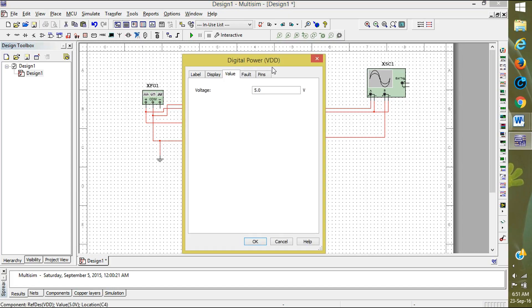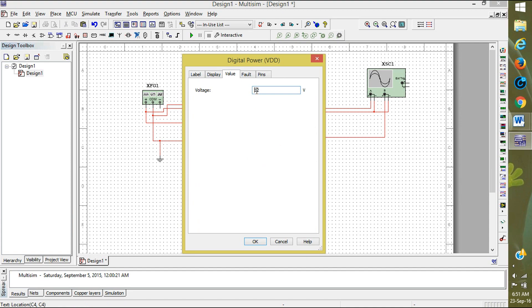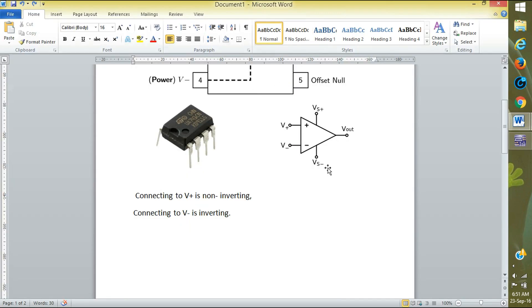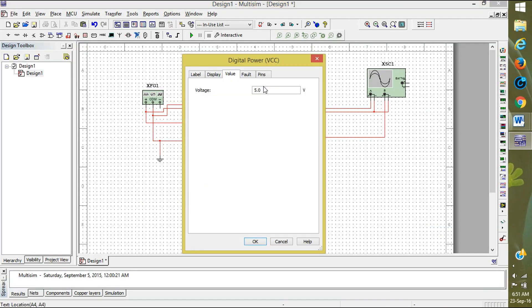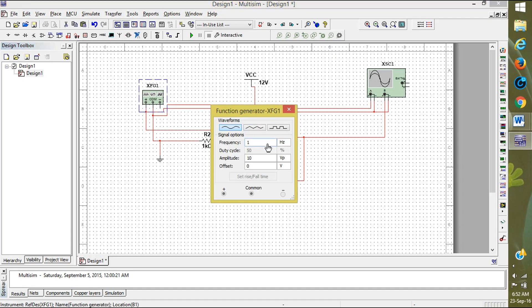Set the voltage value. Click on the number and you will get the value. I am changing it to 12 and pressing Enter — sorry, minus 12. For VDD we have to give minus voltage, since we need minus VS. And here set plus 12. So we have plus 12 and minus 12. Now I think all the components are connected — leave the offset pins as they are.